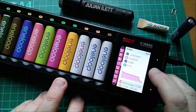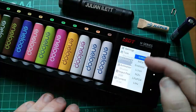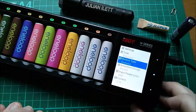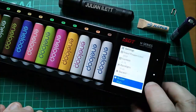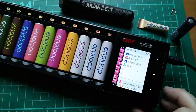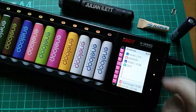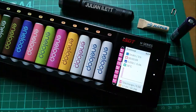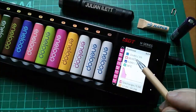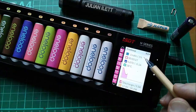I don't think it'll make much difference. Press and hold — battery type — and there's no auto setting here because you only get auto on charge. Let's bring it down to Eneloop. When I changed the setting, the lights went out and came back on — it's actually starting the process from the beginning, and all my milliamp-hour counters have reset. Total accumulated charge in milliamp hours is negative when discharging, and there's a percentage state-of-charge indicator.